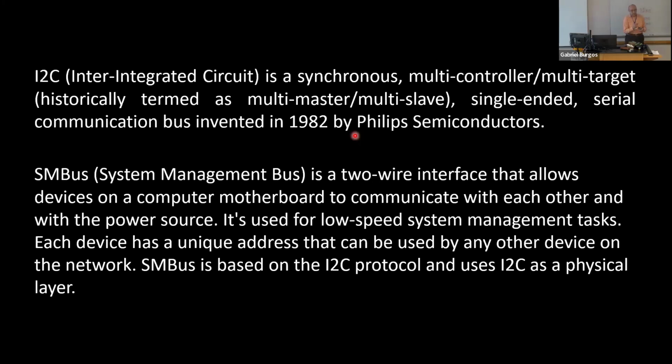So this thing is about the size of a very small postage stamp, and it's mostly just a carrier for the actual sensor, which you can't see, but it's about maybe a third of the size of a grain of rice on here. We're going to get into the data sheet, and you'll see how capable that thing is. This little daughter board here is basically just a way to bring the 6 pins from this little sensor out to pads.